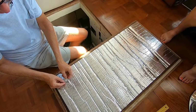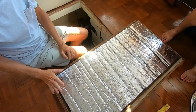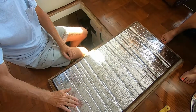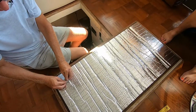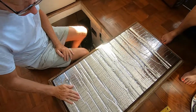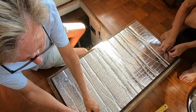So take and push it on very slowly. If you push too hard and too fast, you're just gonna ram down on your soundproofing and cave it way in, and like I say, these won't back off. So very slowly push it on until you just touch. That's all you want to do, is touch. You don't want to actually be putting pressure, so just touch your soundproofing.